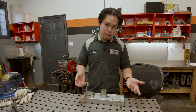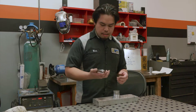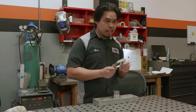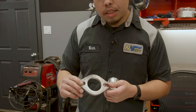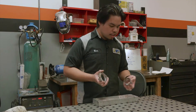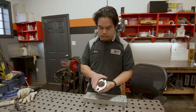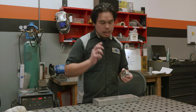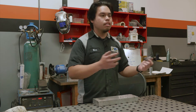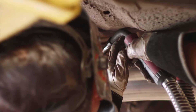When it comes to making exhaust systems or anything to do with flanges, obviously you're going to need your flanges and your pipe. Here I've got a Vibrant 2.25-inch flange and a pipe which should slide right on top of it. Something you want to make sure of when building an exhaust is, depending on the flow and direction, you want your flanges to be kind of the last weld or the first, depending on where you're going.